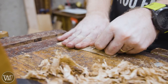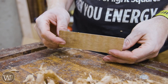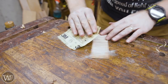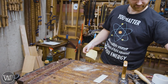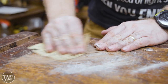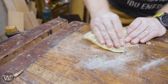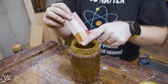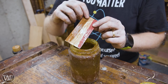And just like that, we have a thin stock bookmark. What do we need to do with these? We need to apply some BLO — boiled linseed oil. It works pretty well; just make sure you clean it off completely before putting it in the book, otherwise you'll get stains. Before I put on boiled linseed oil, I like to hit it with some high-grit sandpaper — this is 400 grit. That loads really fine dust down into the grain, which will allow the BLO to soak in a little bit more and you get to see more of those colors come out. On this one you can actually see some tear-out on that purple heart in the corner — the grain was switching and I just couldn't quite get that out. But I was really happy with how the color came out; it was very pleasing to see the different change through there.